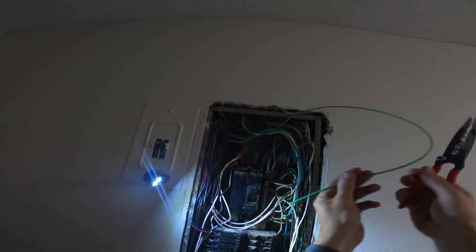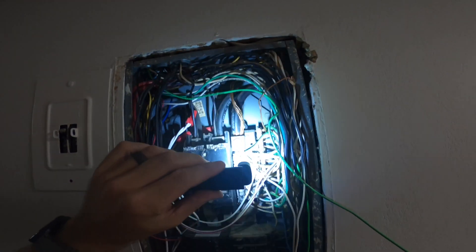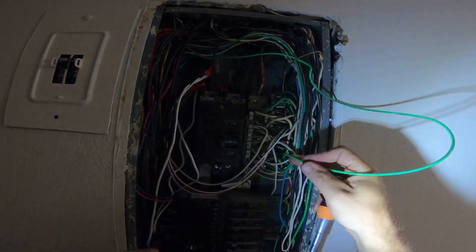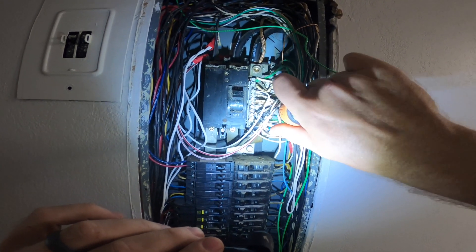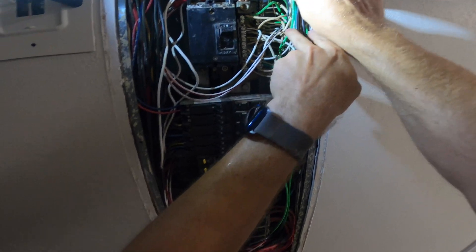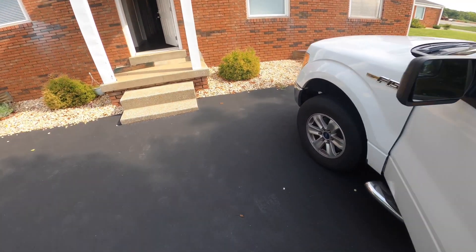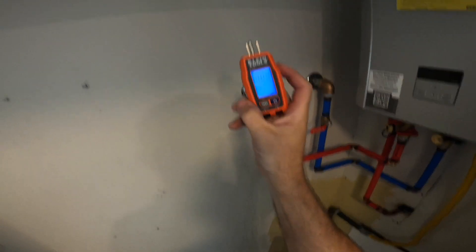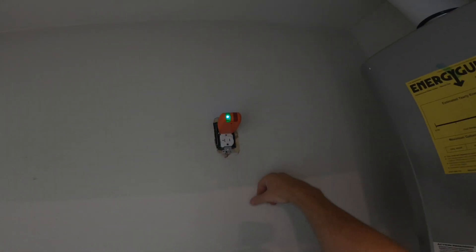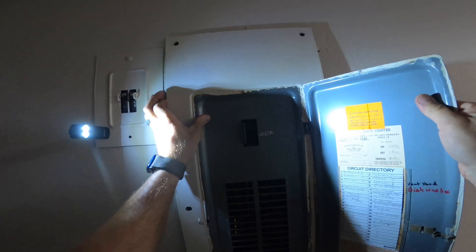Now I've got to take that ground wire and get it landed onto the bar. I left this wire pretty long because this panel is full to the brim and the screw is way back in the back on that bar, so I'm having to find a spot and do a little finagling to get it in there and tightened up. Got that all landed. I went out to the truck to get my receptacle tester. Now I'm going to flip the breaker on, go in, and check it — making sure it's correct wiring and 120 volts, which it is. I check both slots on the receptacle and they're both the same: 120 volts, correct wiring.